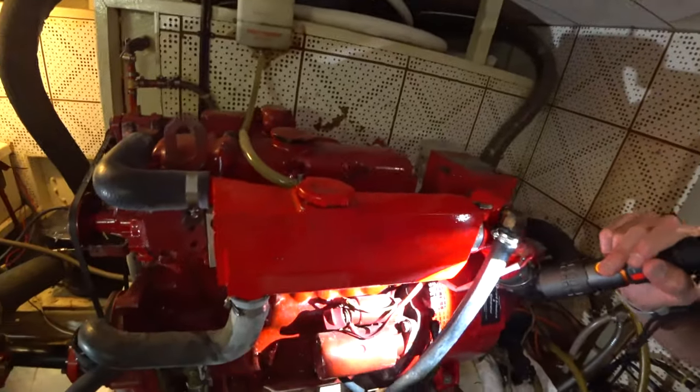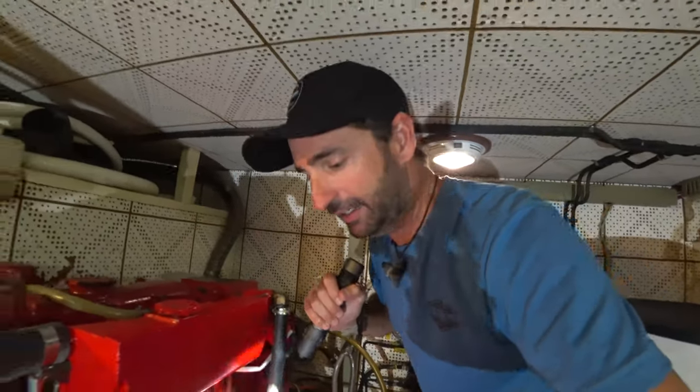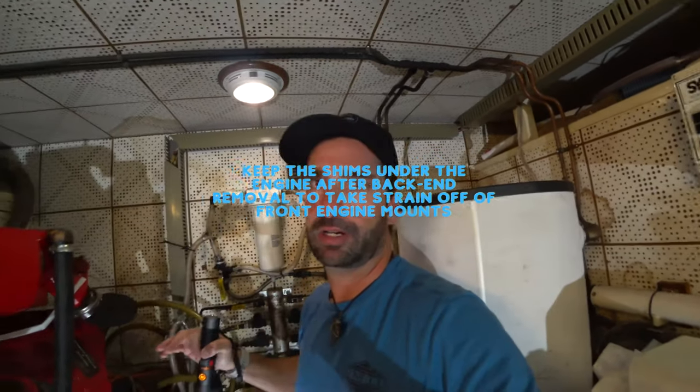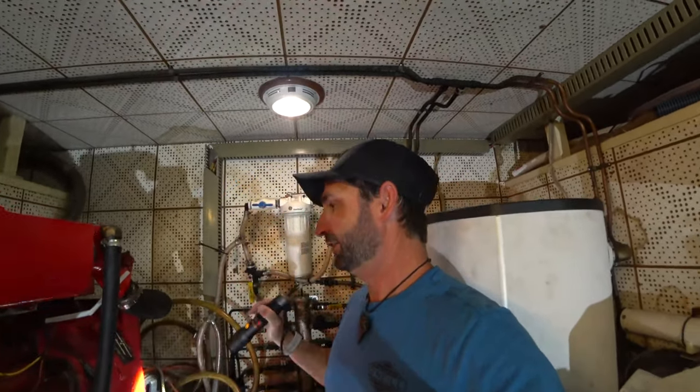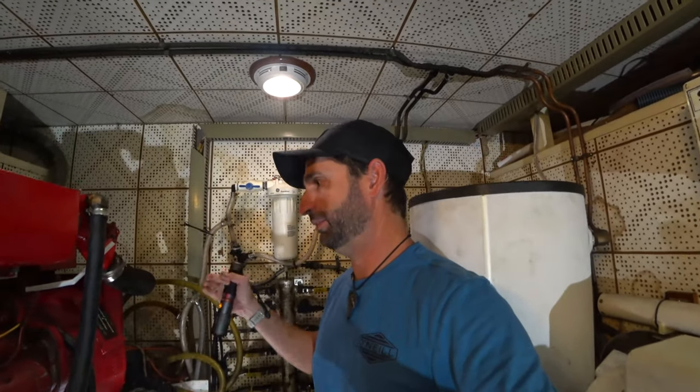I used screwdrivers to pry the back end off and pull it the rest of the way. And as I'm removing it, I've got it shimmed up with dunnage so it doesn't screw up the armature as you're pulling it off. When you're putting it back on, I had an extra set of hands to shim up the engine so the stator could go on smoothly and mate up to the engine block. For that last little gap, I just pushed it on as far as I could get it, then put the main bolts through and wrenched those down to get it the rest of the way.